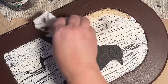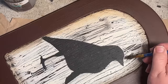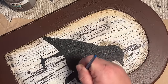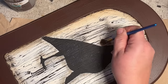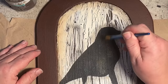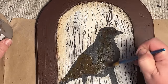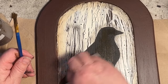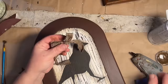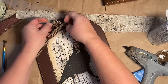So now I'm taking some antique wax after I've spray sealed this with my clear Rust-Oleum spray and let it dry. I'm going to take the antique wax and go around the edges of the mirror, just doing a little swirling. I put it on the brush and then wipe a lot of it off — that helps me keep it from getting too muddy. Then I take a paper towel and wipe it back, kind of fanning it in towards the inside of the mirror to give it a distressed look. I'm also using a little of the antique wax on my bird. I think this looks really good with the black and tan tie and a little rusty star — it came out really really cute.